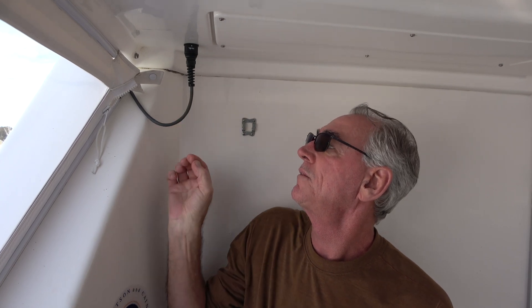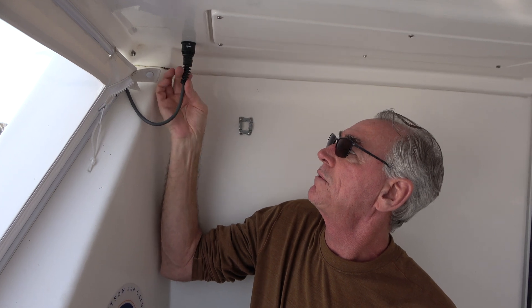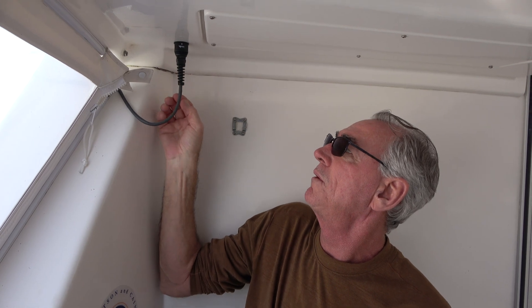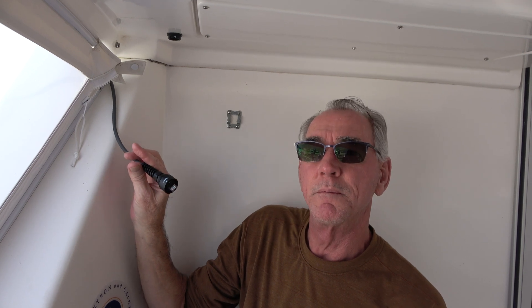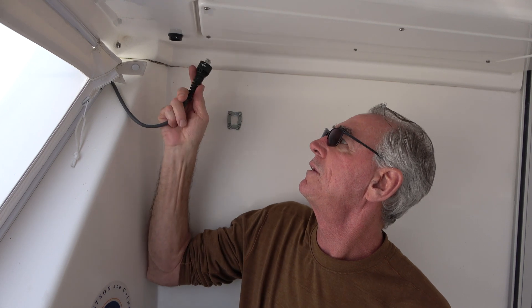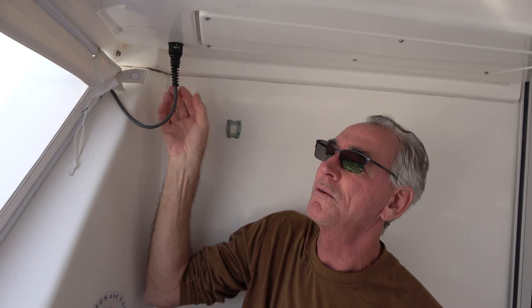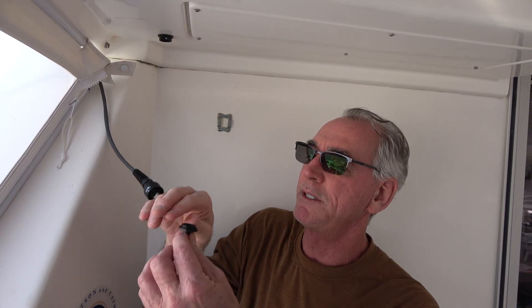With the short piece of cable coming from the dish mounted on the coach roof, we connected it right here — this is where we cut the cord. We used a bulkhead fitting with some strain relief, mounted right there on the corner of the boat. You just turn it and it pops right out, then the dish comes back inside the boat for security. To put it back, it slides in, snaps in, and you do a twist.